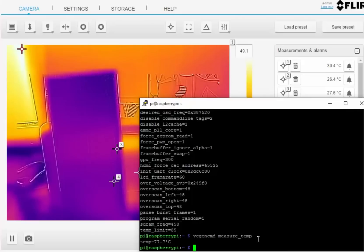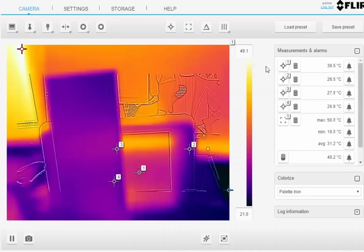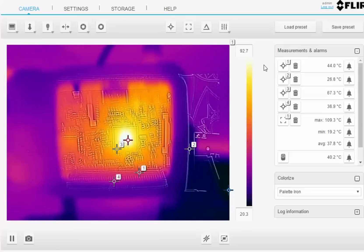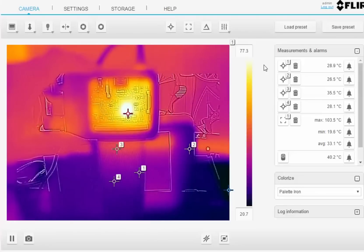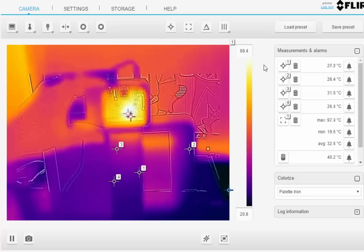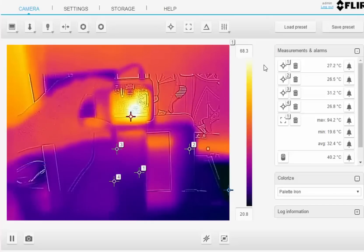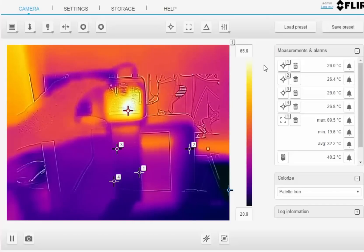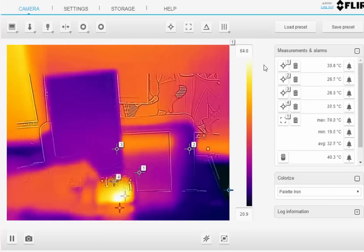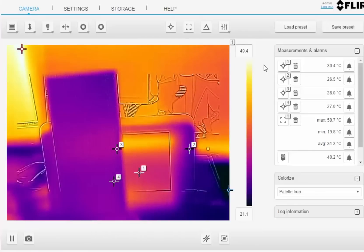It's not necessarily telling you the CPU temperature — it's probably just telling you the average GPU temperature. If I deliberately hold the thermal imager back so it's using fewer sensors and doing more of an average, way back here it's now reading in the high 90s — so it's lost about 10 degrees. Come back further and it's reading about 90s. Even there it's reading much, much higher than the thermal sensor is reading. So I would imagine that the thermal sensor is probably on the outer edge of the chip. I don't have an image of the silicon, so I don't know precisely, but it is certainly not smack in the middle of the CPU.